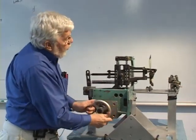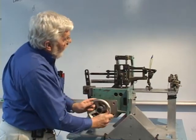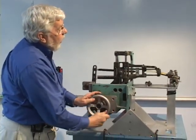So this, I hope, gives you some idea of how cams and linkages are applied to real machinery. Well, you've seen a demonstration of the pick-and-place mechanism that used two slider mechanisms plus some additional linkage to rotate the grabber, which moves apart from an assembly line into some kind of an offloading chute.